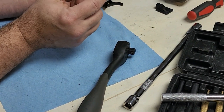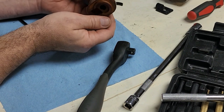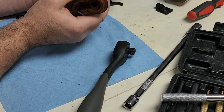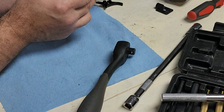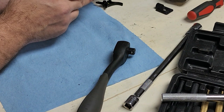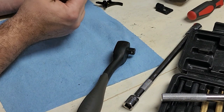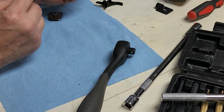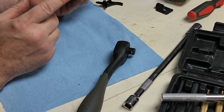How you prepare your 880 stock: when they come from the factory they have this raised ring or partial ring, and that has to be removed. It's not very thick, so it's not a whole lot of work. If you've ever used a wood chisel, you can carefully remove it. If you're uncomfortable doing that, take a wood rasp and get it low, then finish with sandpaper. You can also use a file. You don't want to chip it out, gouge it, or mar the side of your stock - just use a little bit of care when removing this ring.